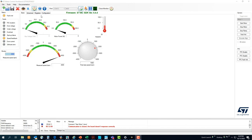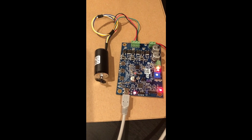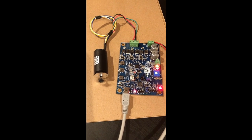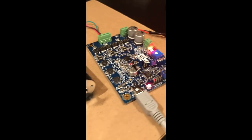If the board is connected, we can move to the advanced tab and from here select the control mode — either speed or torque. If we select speed mode, we will need to tune the parameters KP and KI for the IQ/ID regulator and also for the speed regulator. There are tutorials on our YouTube channel and website for this procedure. With the motor and board connected, we click on the start icon and the motor will start to ramp up the speed. That brings us to the end of this short video demonstration — for more information, please visit our website.